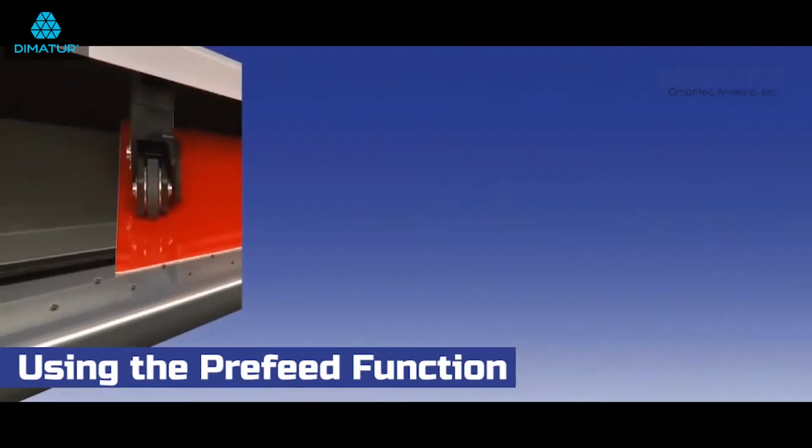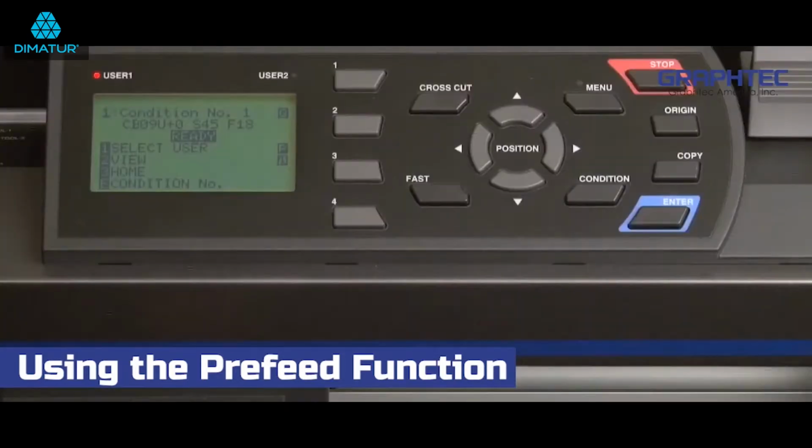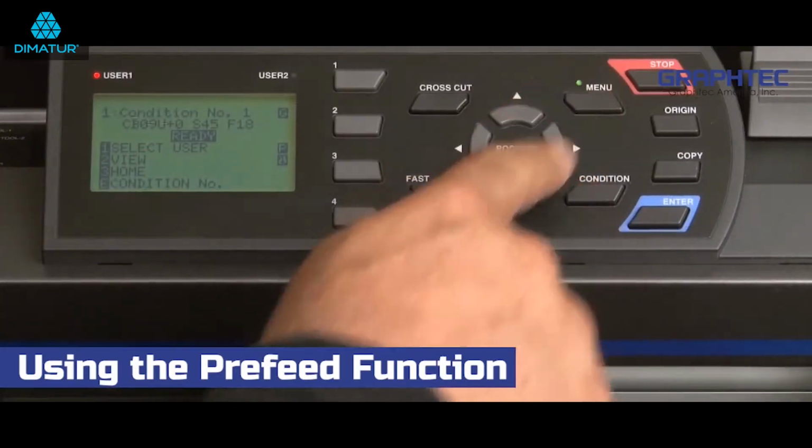The difference between how these two functions operate is that Prefeed feeds out the material to establish the tracks immediately, whereas Auto-Prefeed sets the cutter in a mode that, prior to cutting a job, will automatically pre-feed the material to a predetermined length. To use Prefeed, press the menu key.